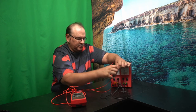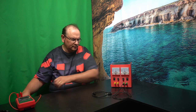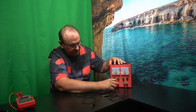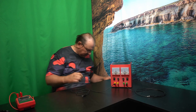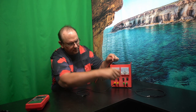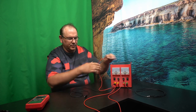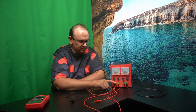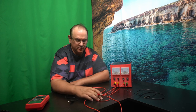The final configuration is sometimes useful for creating a center-tap setup. You have one output on each end, and you connect the two coils together in the middle, taking that as a third output. So basically you have three outputs — one end of each secondary coil, plus the center tap. This configuration is very often used when powering plus-minus voltage regulator circuits.